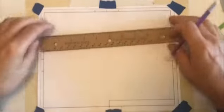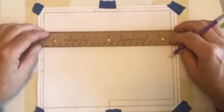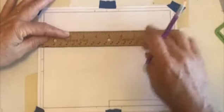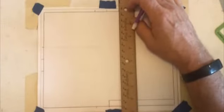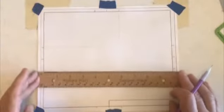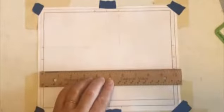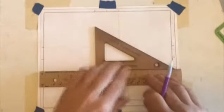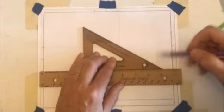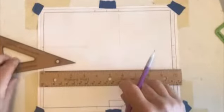I'm just going to draw lightly a line across there — you can see a line is lightly drawn. Then I'm going to come up here and draw a line lightly up here as well. When I come up here at this point, I'm going to go ahead and line this up, and from here I will make a mark going that way. I'll come back down and line this up, and I'll take my 30-60-90 triangle — this is the one I made on our laser engraver at school — and line this up here on this corner to draw my diagonal line. So now I've got this quadrant laid out.